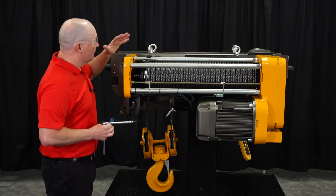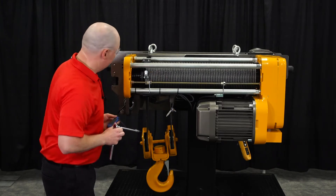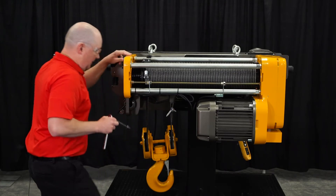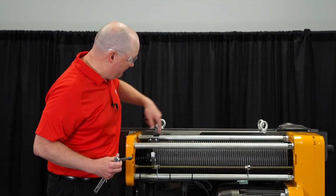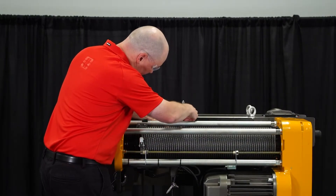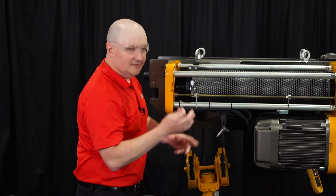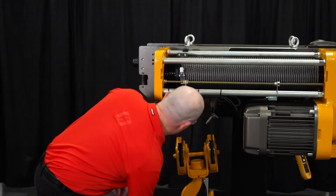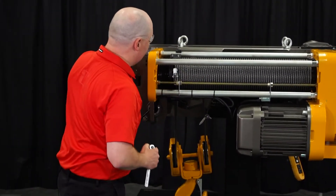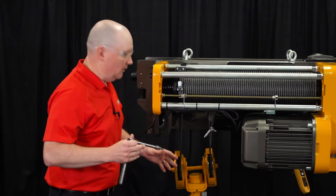We're going to start with removing this Rope Guide — opening it up to allow removal while it's still on the hoist. The first thing we will do is remove the socket head bolt from the side that goes around the top portion of the bar. As each socket bolt is removed, I always like to thread the nut on it slightly, because you're more than likely up on a man lift and you don't want your hardware to fall down. Now we're going to move to the underside and show you how we disassemble a brand new Rope Guide.